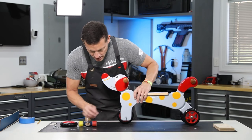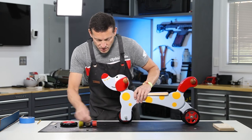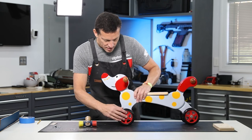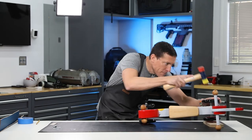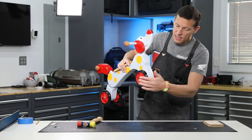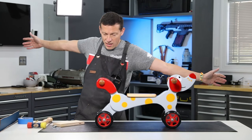Boonk. And on the other side, you guessed it, a 5/16 washer, 5/16 spacer, 5/16 washer, the wheel, another 5/16 washer, and we'll put the little cap nut here. It is on. And the wheels spin freely with these being tight because they have their own bearings. The little push toy is completed!